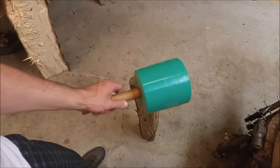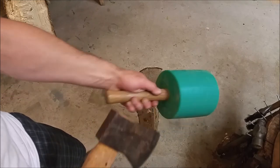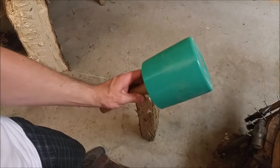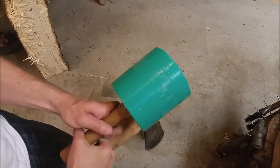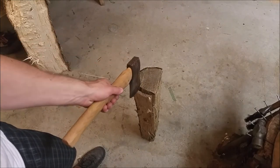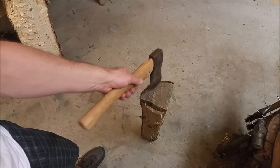If you don't have one of these, you can make one of these. The plastic is nylon, bought from the surplus store; the handle is just a piece of white oak, and this thing will last pretty much forever. I have just a random hatchet here. You want to score where you're going to be splitting first, so you actually create a bit of a weak spot for the wood to split along.